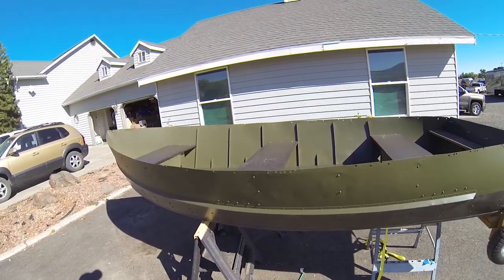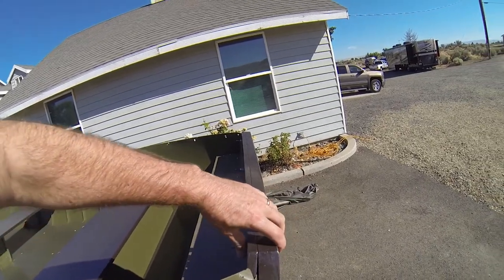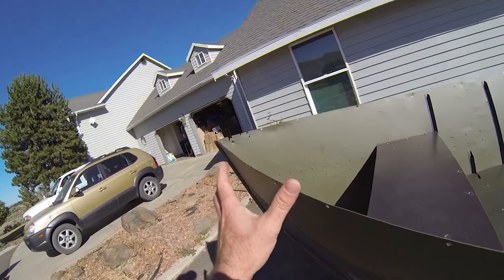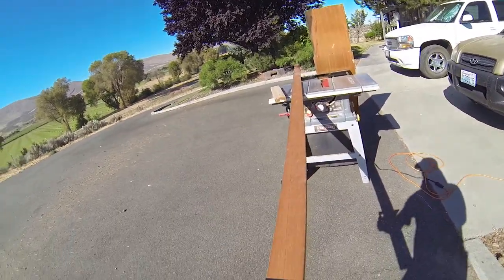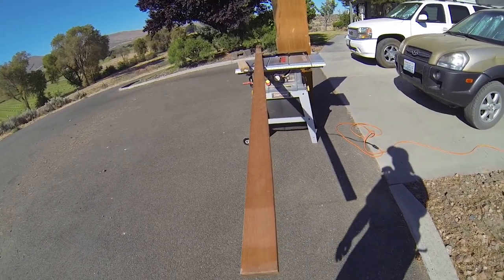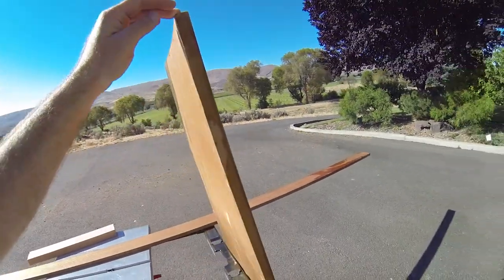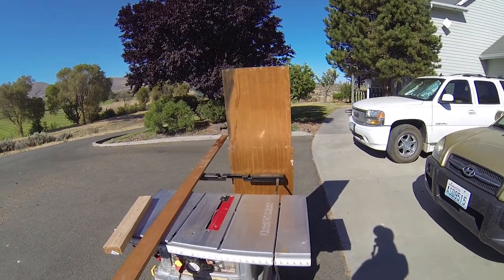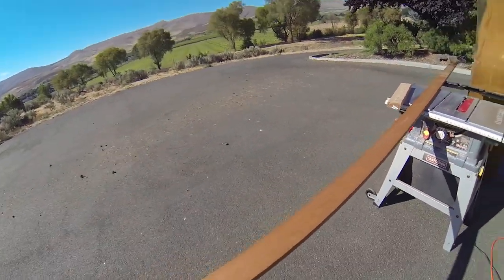The trick is to sandwich the metal between two pieces of wood, the same way we did for the transom — a thin piece of metal with wood on either side. That wood is gonna have to be custom bent to the contour of the boat, and the farther towards the bow we get, the tighter that curve gets. We have one 14-foot-long piece of mahogany about three and a half inches wide, and we're gonna rip that down the middle to make an inside and outside rail for both sides. There's another piece of mahogany about five feet tall we'll rip into strips the same width. Where the junctions of the pieces meet is where we'll put rope ties, anchor cleats, and oar locks, bolt them through the middle, and hopefully hold it all together. Then we'll seal it with Thompson's Water Seal or something similar once it's all sanded.